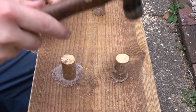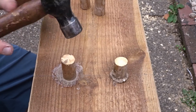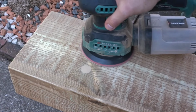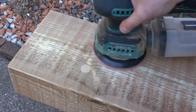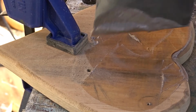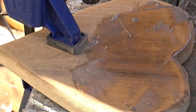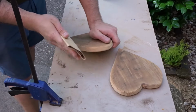And it is crucial that you use the finest sawdust. I can't stress that enough. So as you can see now, I'm just sanding over the tops of those. And again here I'm just using it to fill in some small nail holes. You can just see how spreadable it is. If you want to make it a little bit drier, just add a bit less glue, and then just sand down.